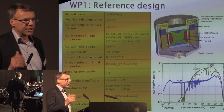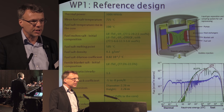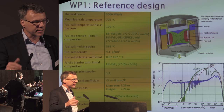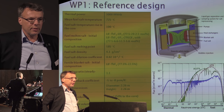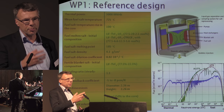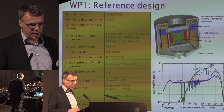We have salt at about 700 degrees C — this is lithium fluoride. We have two fuel salts: the primary one is lithium fluoride with thorium fluoride and some uranium-233 in it. We also have an alternative salt with transuranic loading, in which you can burn plutonium and minor actinides from light water reactors. We have a strong negative feedback coefficient — salt expands when it heats up, reducing reactivity strongly. With that, you can easily do load following with a molten salt reactor, and I will show some simulator results on this.